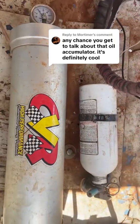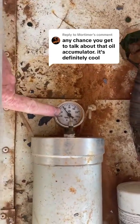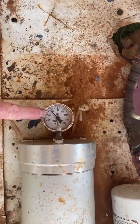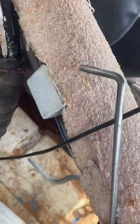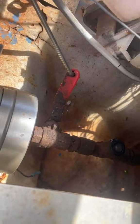We'll talk about it — it's a little tough to get in here and show it to you. When this thing is loaded, it has almost 60 pounds of pressure in it. It just depends on how much oil pressure you get with your engine, what'll load it up. Mine just has a manual valve on it right here, hooked to this little rod — really janky, but it works for me. You can get electric valves for them too.